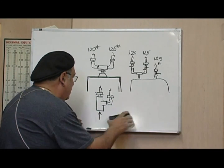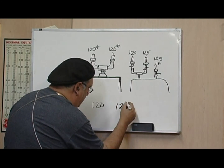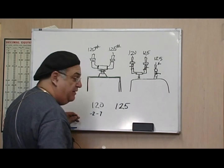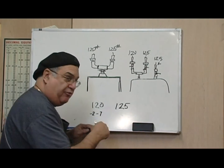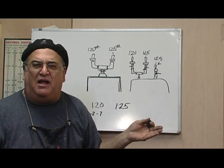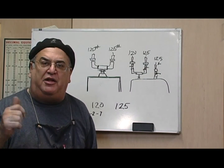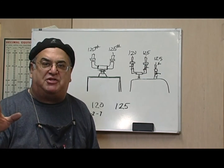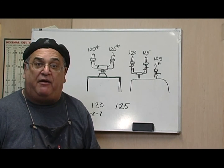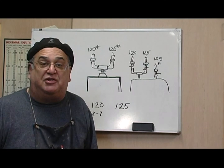What it's for is: when you have two valves set at 120 and 125, this is what it should be. I try to get my safeties — two is the minimum differential, seven is good. That's why I don't like it when some geniuses in the hobby say it has to be 120, can't go over 120. Why? Why can't it be 130, 135? I tried it with my new safety valve on the K4, and the injectors work better. The steam is a little drier — if you're talking about superheated steam, just jack the pressure up 10 pounds. You'll be surprised, it'll be drier and everything. 130, 135, even 135 and 140 — there's nothing wrong with that. That's only a 15-pound differential. The boilers can handle it, and there's no problem with that.